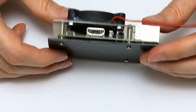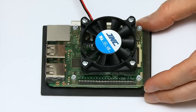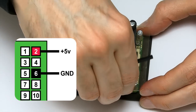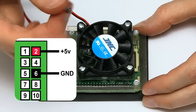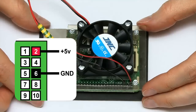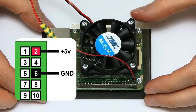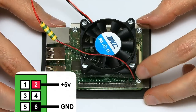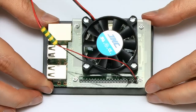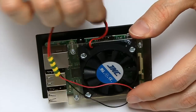This is quite a decent little construction. All we have to do now is connect in some power. We'll connect the negative rail to the ground pin — that's pin 6. And we're going to connect the positive 5 volts to pin 2. Just to point out, you can't run a fan from most of the GPIO pins on the Pi — they're limited to 3.3 volts and would nowhere near supply the amperage required. So only use that 5 volt pin, which can supply effectively all the voltage from the power adapter that isn't being used by the Pi itself.